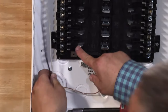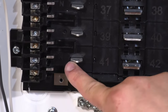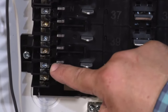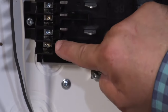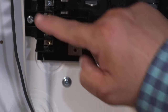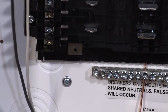If you look really close over here, you can see there's a little 'N' in there that stands for neutral. You can see the color difference on the screws — the neutral terminal is silver and the hot terminal is brass colored. So our white conductor is going to go on the silver screw and our black conductor is going to go on the brass screw.